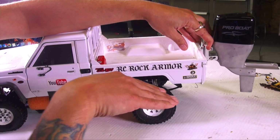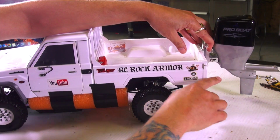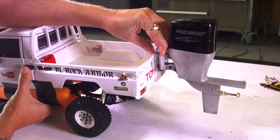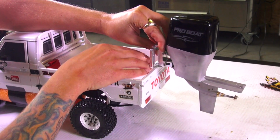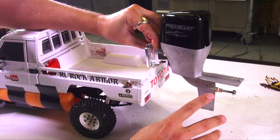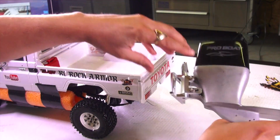If I was entering the water at a reversed angle, basically going down, and then I start to flatten out, I'd start to drag this rudder. The other thing is that if I lifted it up too much, let me put it right here, and say put a brace on it right there, the prop I don't think is far enough in the water from the way it's floating. It's just barely in there. So I've had to devise a way to mount this up.